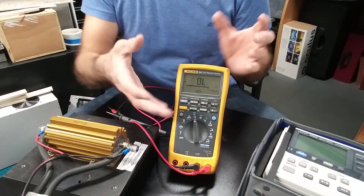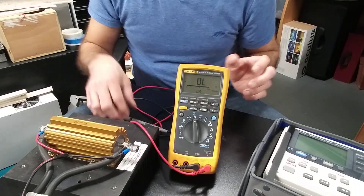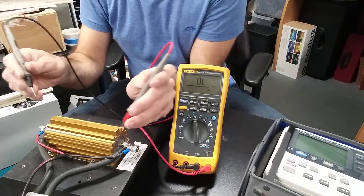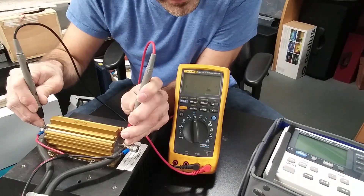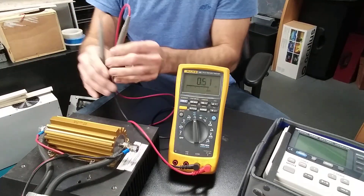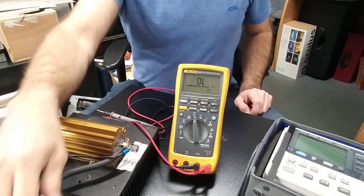You can see it's a much closer value to the real value than measuring without nulling or compensating for the probe resistance — without compensation I get 0.7, which varies a lot. That's why I've installed four wires.